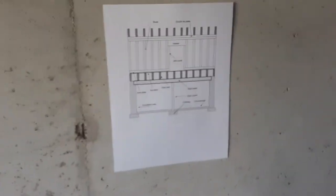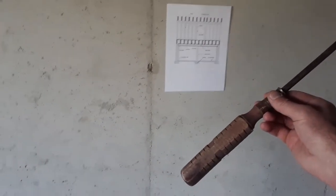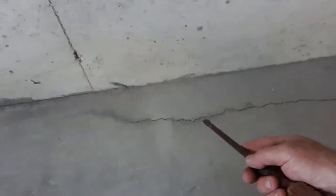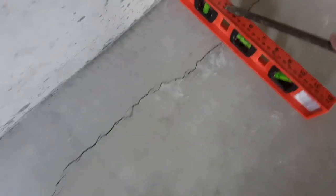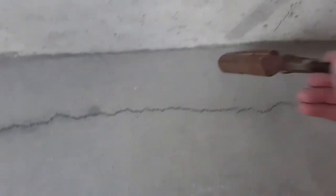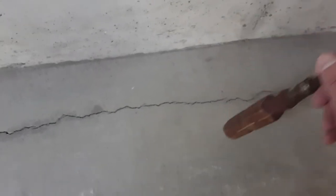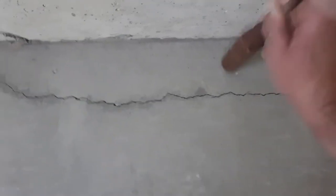Tapping on concrete floors — this is my flat-head screwdriver I use when looking for voids and missing soil under concrete. Right here is your foundation wall, and down below on the slab you'll notice a hairline crack. This hairline crack is consistent and it's following the footing below. You can see it's about four inches wide — that looks about right. This side of the crack is over the footing — sounds dense. This side is the void.